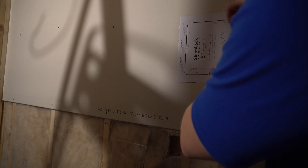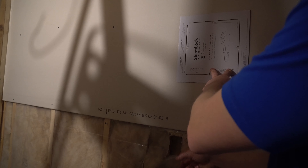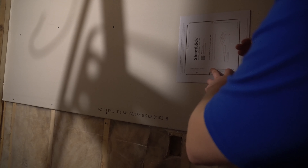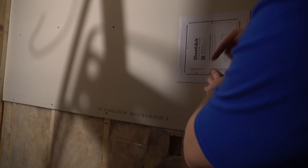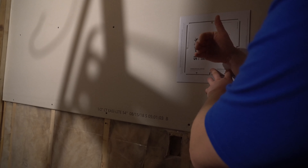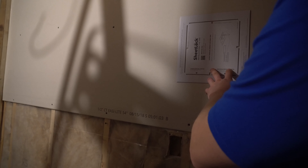If you can't see into the wall, there are two ways you can do this. You can either check from above, but if it's a finished suite and you can't see it, you can check the attic. Or if you have a stud finder, you can go through. What I like to do is cut a small hole, trace it out first, then cut a small hole in the center. Take a piece of an old wire hanger or a fish tape, bend it and turn it in a circle all the way around to make sure you're not going to hit anything like HVAC.